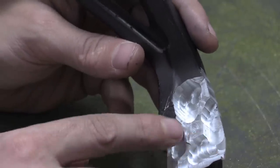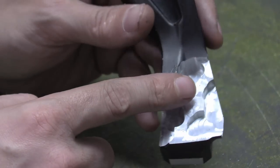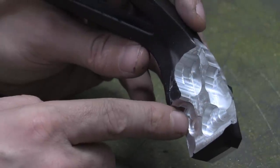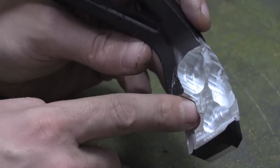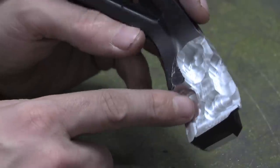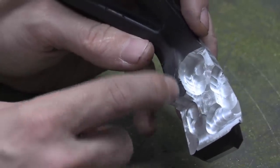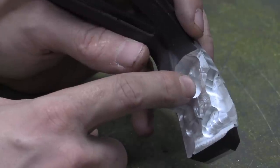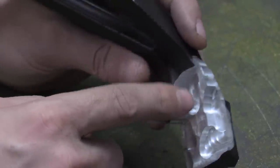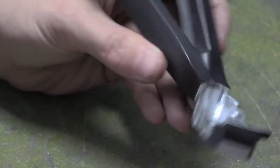People might say, well, you could have done a neater job by doing a smaller radius end mill. The reason why I carried on with the 10 is because, one, I can't be bothered changing it, but number two is I need to be able to allow Frank to get in there. There's no point having a 6mm deep, 3mm wide trough if Frank can't get in there, you know what I mean? So even this, really, I might even open this up a bit more. Like I said, I need to sit down and have a look at it.